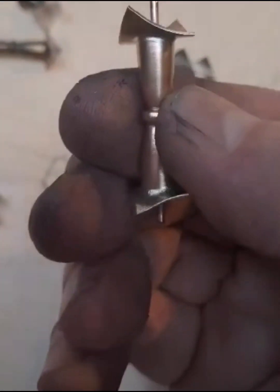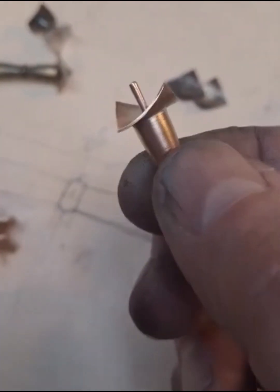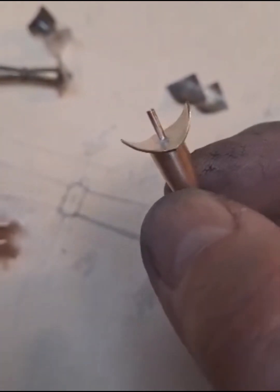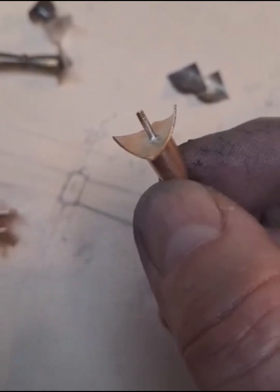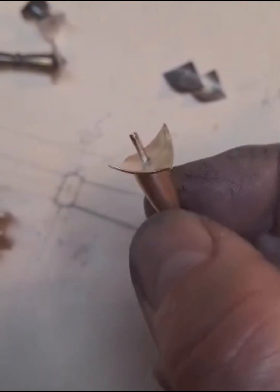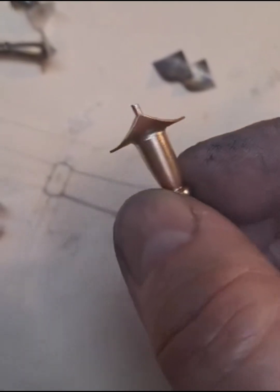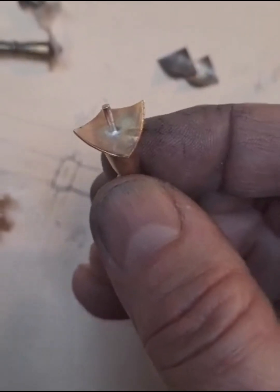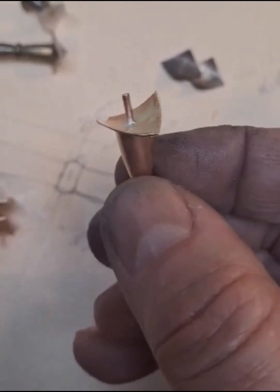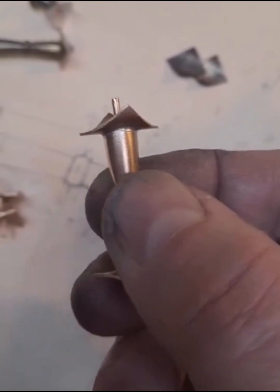You know, they were fluxed liberally. Flux is cheap, and it will get the job done. If you don't get enough flux on there, you're not going to get the best results. Too many problems can arise. So don't be stingy. Anyway, everything was fluxed. It was all pressed together again, and then silver solder was applied at the base of the pin and flooded liberally, but not too much. I did that on one, just a little teeny too much, but that's okay.